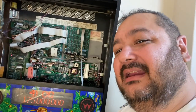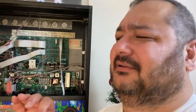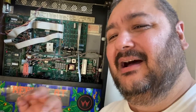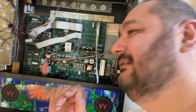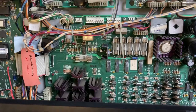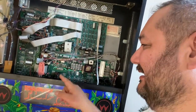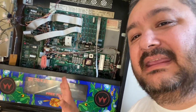But how did I know that I needed continuity from one point to the other? Apart from physically seeing lines on the circuit board, sometimes those lines are on the other side, and on some newer euro circuit boards there might be traces actually inside the board on multi-layer three or four layer circuits. This one's pretty easy - I could actually see the traces. But how did I know where these traces needed to go, and how did I know about this particular component being dodgy and why it was linked to TP3, this test point, and the fuse I was having trouble with? Well, I used a thing called a schematic.